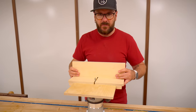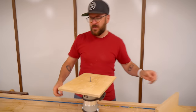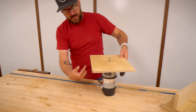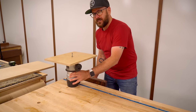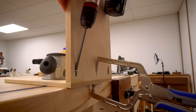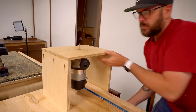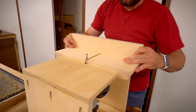I realized before I can move any further, I've got to figure out a way to keep this from wobbling. So I'm thinking about making some legs out of three quarter inch plywood — a front leg that goes down to the bench, and a back leg that's even longer so it fits into the vise and is nice and secure and stable. Pocket hole screws for the win. Now I can screw my router in there. We've got some airspace for the vent and our sled runs right along the top.